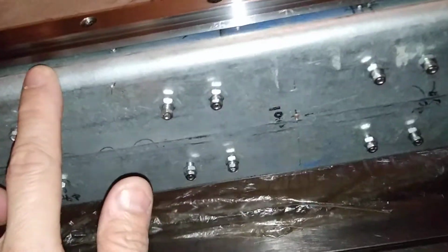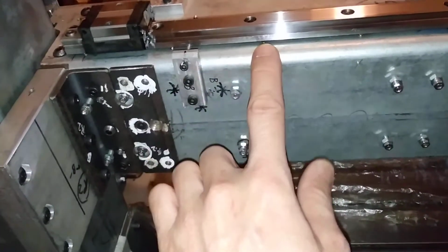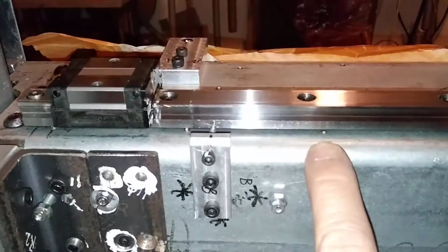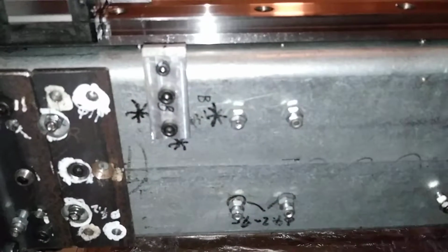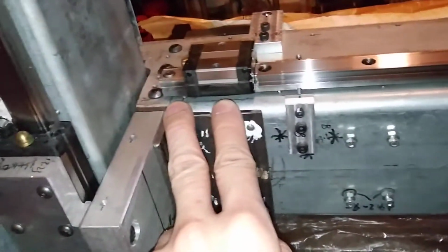And this level is monitored by the screw rod underneath, the bottom side of the rail. You can see here this screw rod, and these are the screw rods with hex head here. I tune it with these tools, and first of all I also loosen all this middle portion screw and screw rod, and concentrate on setting on the extreme ends.